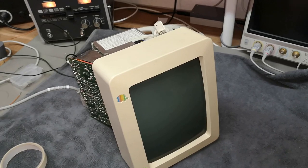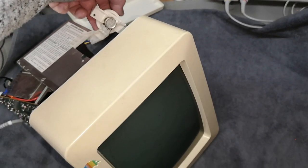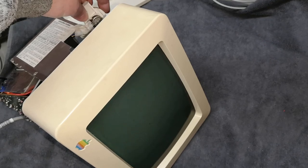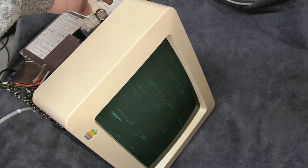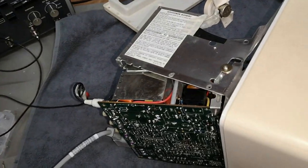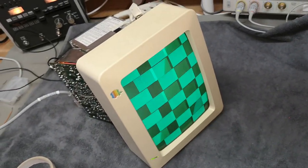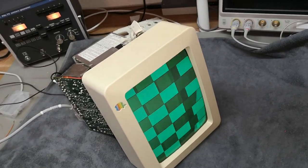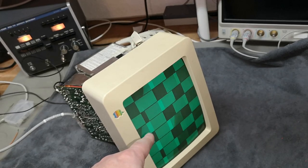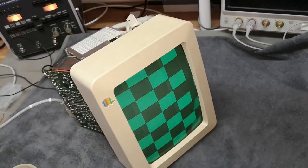We don't see a lot. Okay, this pot meter here is absolutely crap. So the brightness pot meter is just bad. Look at that, and it only works... There's also a sync kind of problem. It's maybe not syncing on this frequency range. That is weird. It should work. Maybe this is only working on 60. Okay, now it's getting darker and darker and darker. And we see some funny stuff, right? Yeah, look at that. Okay, but it's actually a little bit alive, but I'll definitely turn it off immediately.